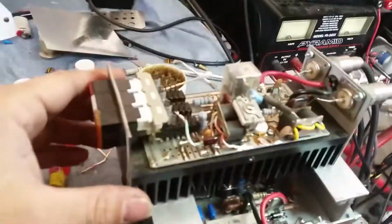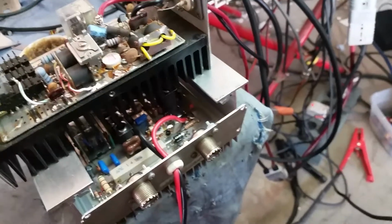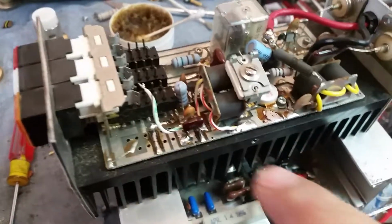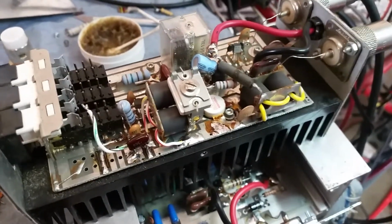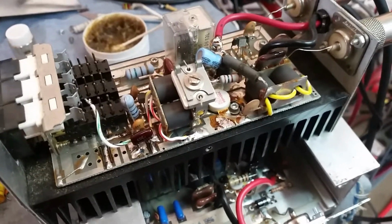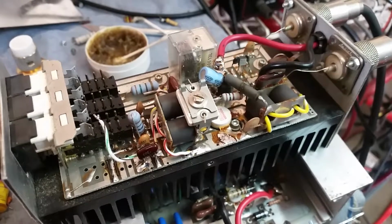All right, brother, got all three of your amps done. I'm just going to roll through them real quick. I know the Texas Star said there wasn't nothing wrong with it. It's a low output amp, man. I don't know if it's the 2290 or what it is, but it still makes a good driver. I did have to retune the input and change the wraps on the input transformer. It helped a little bit, but it's still got a little bit of reflect on the input, but it's a lot better than it was.